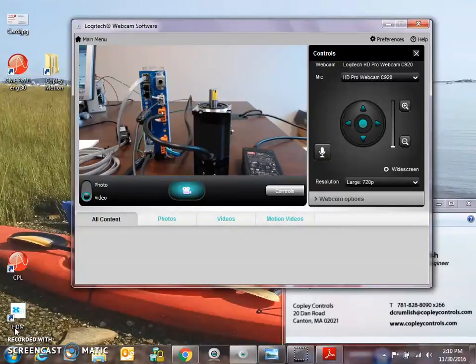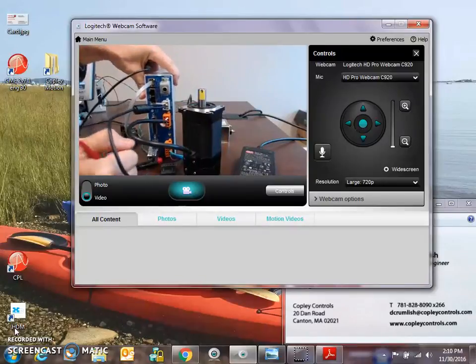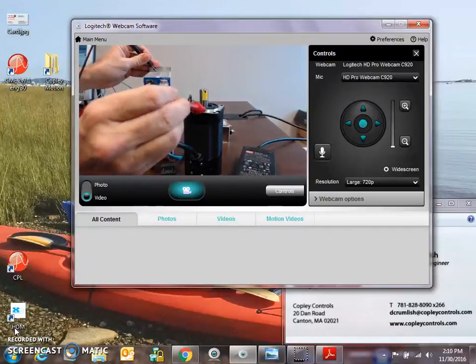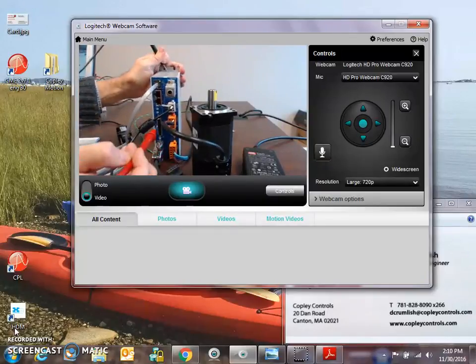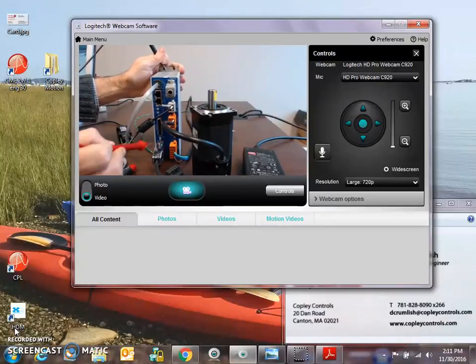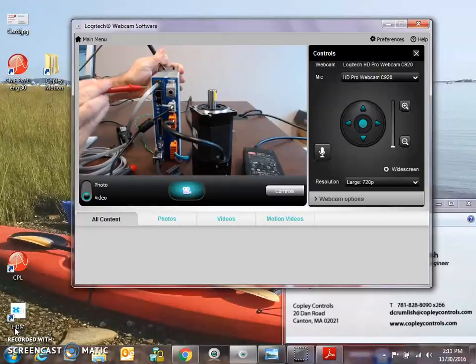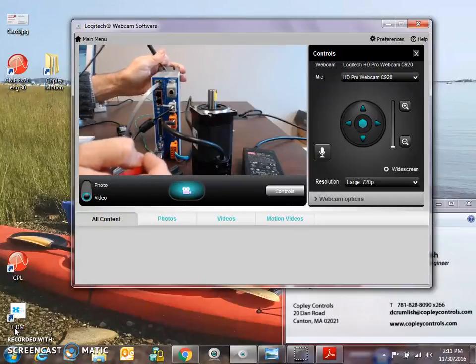Okay, before we go, we're just going to take a quick measurement to earth here. So I've got earth connected to the case. I got continuity from earth to the case. The motor case should find a path to earth through the earth wire on the drive, located here. The connectors, so the feedback shield should find a path to earth. 24-volt supply is not finding a path to earth, so that's something I need to address. But all the shields will find a path to earth, so that's good. Protective earth, also connected to earth.